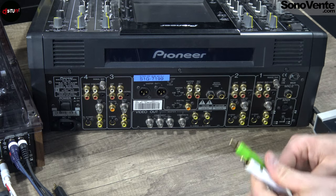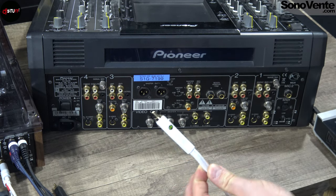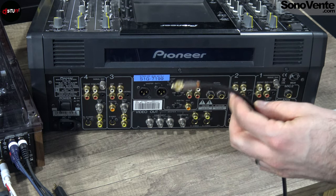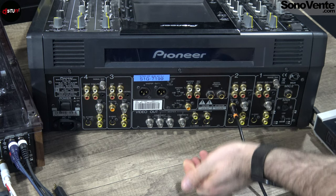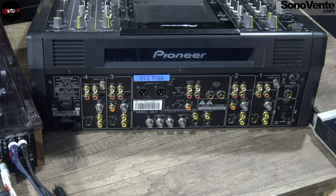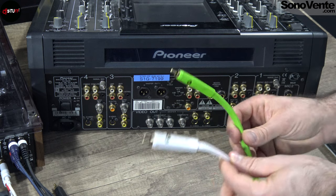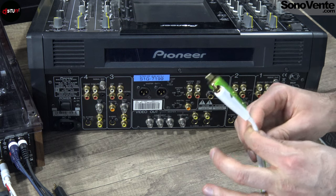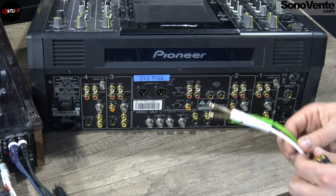You can have just one RCA, but it's a special case — it's an RCA connector but not an analog connection, it's a digital connection. That would be the S/PDIF coaxial connection for digital signals. You can have it on input or output. If you have maybe 50 centimeters to one meter between your mixer and your CD player, you can use a normal RCA cable. But don't use a regular RCA/cinch cable for a digital connection if you have two, three, or five meters between your devices.